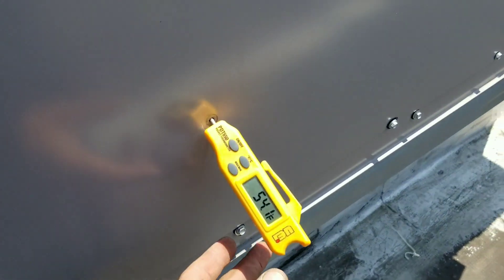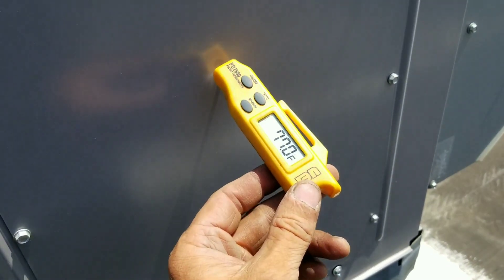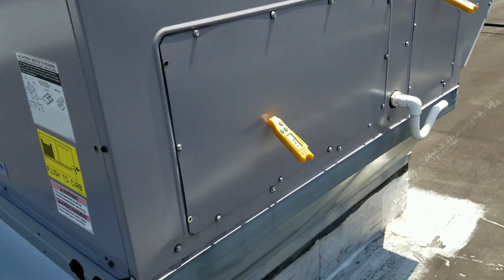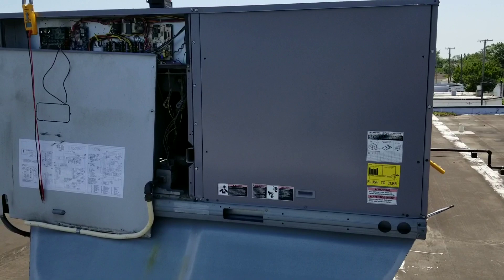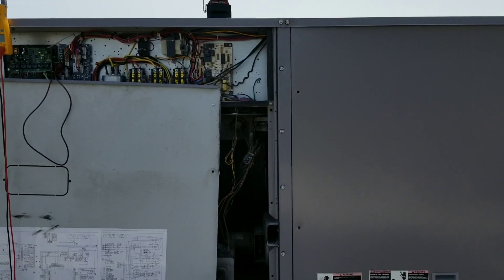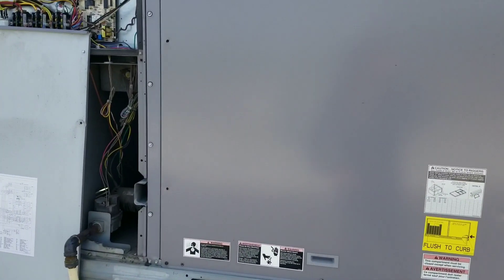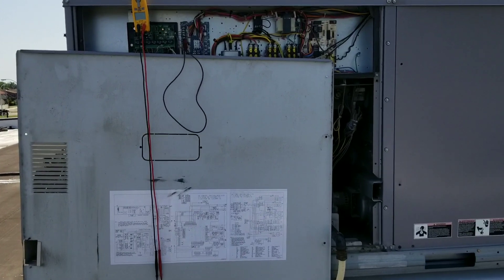We've been cooling for about 10 minutes now. I have a supply temperature of 54.1°F at the unit and a return of 77°F — that's a 23-degree split, which is pretty good. The condensate trap is still really dry, it's been dry for days. All that's left to do is call our energy management company and make sure they have proper communication and we'll be all set. It looks like whoever was here before just miswired the economizer. I don't really have time to speculate why they were sent out here. Anyway, that was a pretty interesting one — hope you enjoyed it and learned something. Like and subscribe, shoot me some comments or emails, any tips you've got.